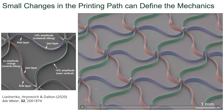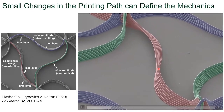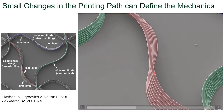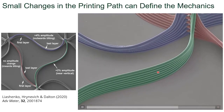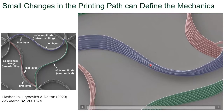For example, here we have a post-processed SEM video in which false colors show that this red fiber is tilting inwards — that top fiber will take the load first, followed by the next one, and so forth to the bottom fiber. The fiber wall that is green has all vertical fibers, and in this instance the fibers will take the load at exactly the same time. Whereas the blue false-colored wall is tilting outwards such that the bottom fiber takes the first load. So you have a structure overall that will have different mechanics depending on which direction you pull it, based simply on the slight tilting of the fibers.